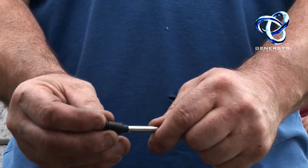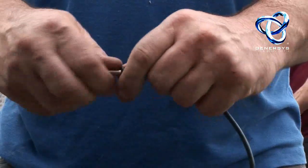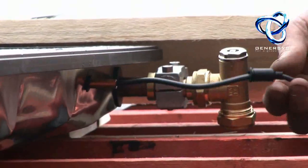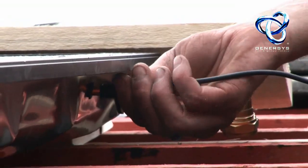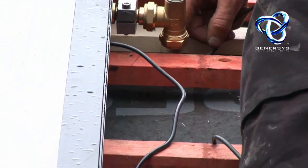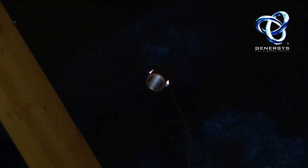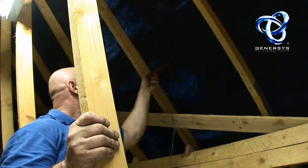For a sensor pocket system, you'll need to fit a sensor pocket and a sensor into the sensor pocket of the panel, and secure it with a little rubber hose to make a tight fit. These are support sleeves — it's good practice to use them. The sensor wires go into the house along with the pipework that will form the heat circuit.